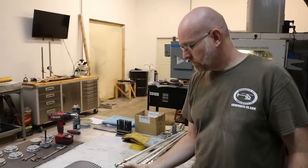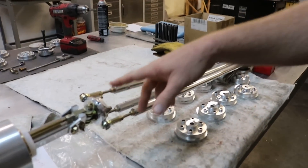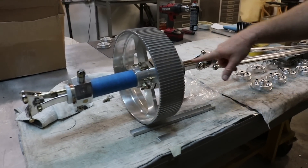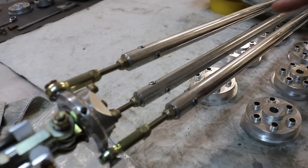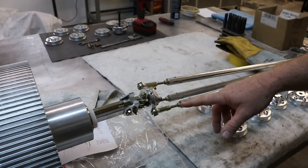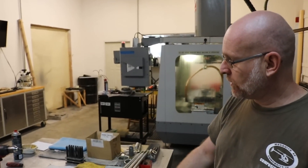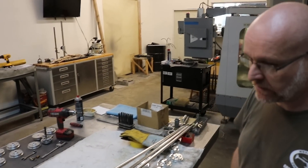I can point this out in the machine when it comes to it. This is what the operator is flying. You're seeing this in a configuration you might not be familiar with — it's on its ear — but this is our final pulley. And just underneath it, through our control structure, is our swash plate, and the mixer assembly being down here. This is what the operator is really flying. They're flying the swash plate, and the swash plate is flying the rest of the machine. One of the first reactions is, isn't it cute — look how small that swash plate is. It is decidedly small, but that's all that this machine needs. This is tucked away in the backbone of the machine.